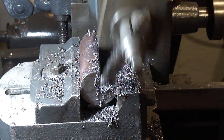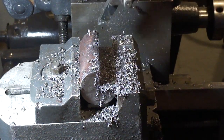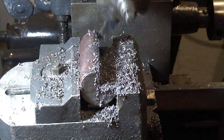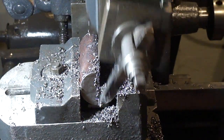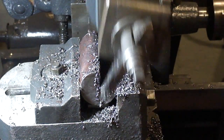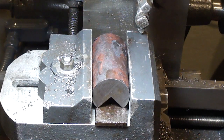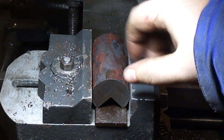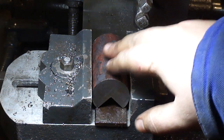I'm just feeding up by hand, going across and feeding up very finely so it gives a good finish. I'll measure how far I'm off because I want both directions to be equal. I've got the V-groove cut and it's equal on both sides. Now I've just flipped it in the vise and I'll tighten everything up and do a cut on the bottom here. Then I'll have two reference surfaces.